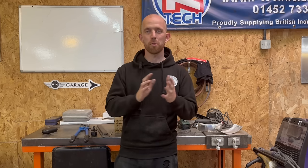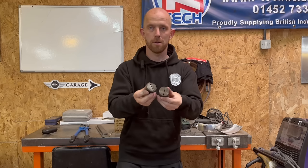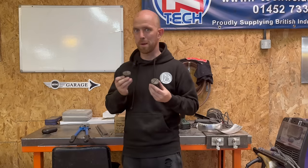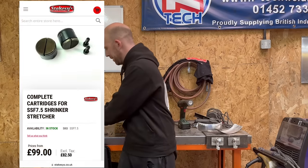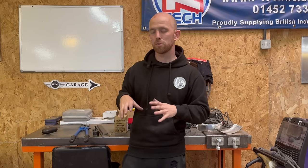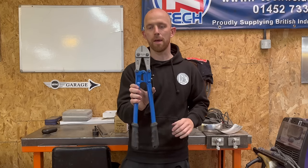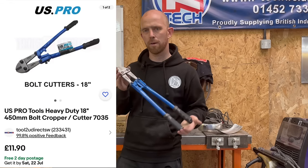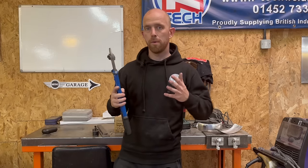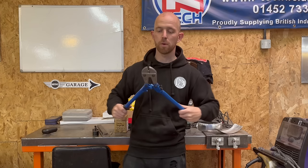So I've gone and sourced a set of shrinking dies — really nice ones actually from Stacey's in the UK. I'll just bring them up to the camera — really nice. I've been using these for a few weeks now and use them all the time on other jobs. I'm going to be using them on this handheld shrinker, and the tool I'm going to be modifying is a set of bolt cutters — 18 inches long, cost me around £13 on eBay. All in all, a lot cheaper than buying one ready-made.